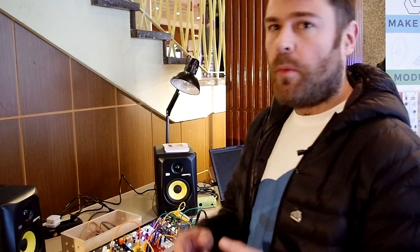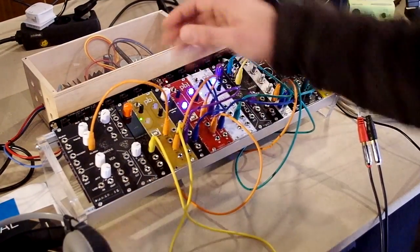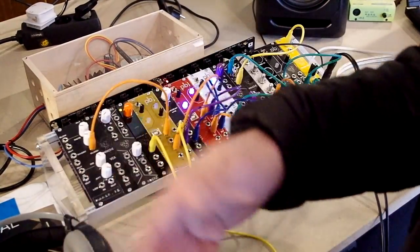With the Patchblocks module, you can program a patch in the software editor, and once you've written your patch, you can upload it via USB to the module and then interact with all your other Eurorack modules. Some of the things you can do, for example: a one volt per octave oscillator, a clock divider, a multiplier, a drum trigger, a drum player, a drum sampler, or a sequencer. The patch can also be changed — you can upload a new patch and it could become an LFO, for example.